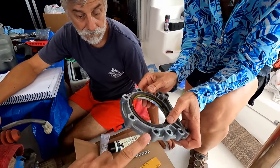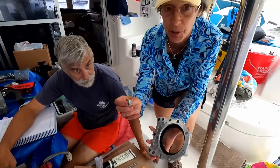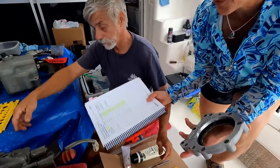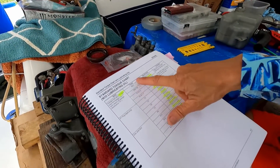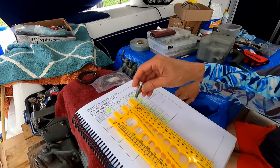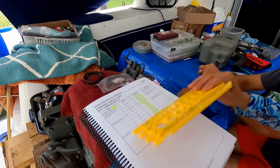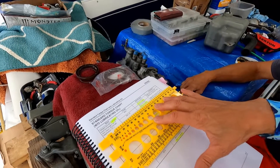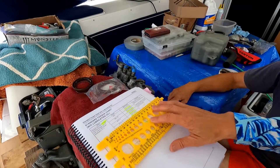The bolts are ready according to the manufacturer's specification. The bolts are marked as 7, which is typical for this engine. The Yanmar manual tells you that hex bolts are marked with a 7, and then you have to figure out whether it's an M6 or an M8 using a bolt measuring tool. It measures as an M8. The torque for M8 is 16.1 plus or minus 4.4 foot-pounds, so we'll use 16 as our target.